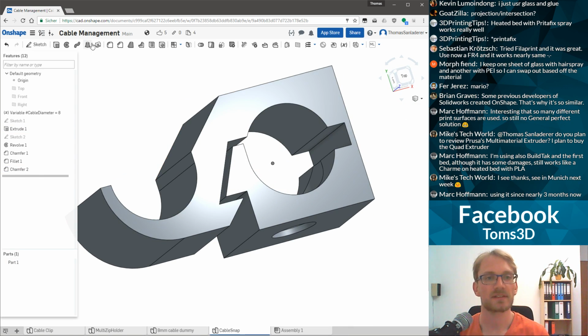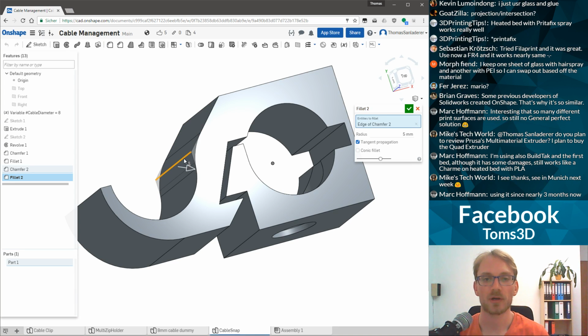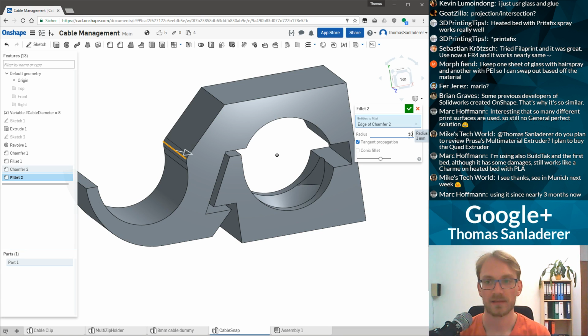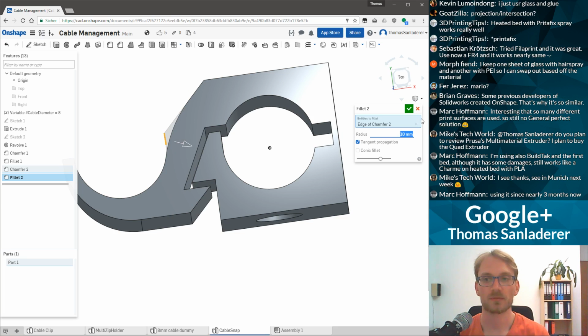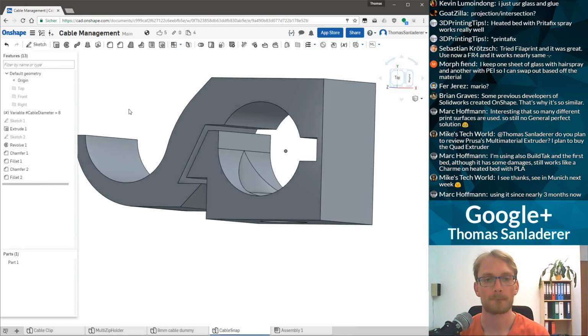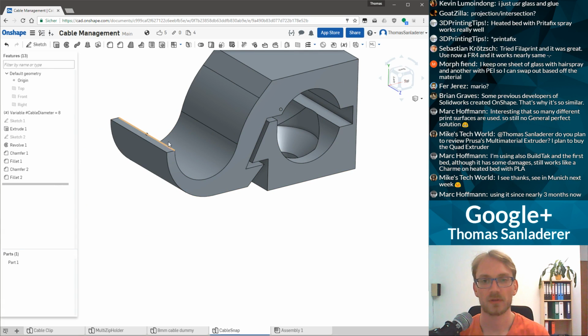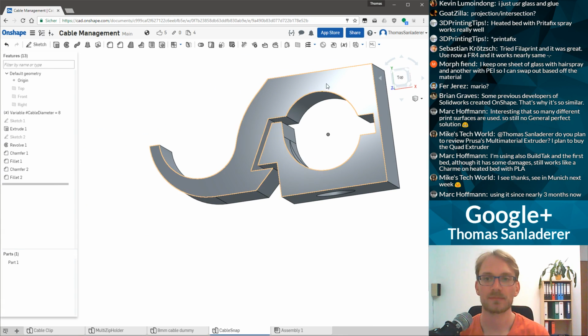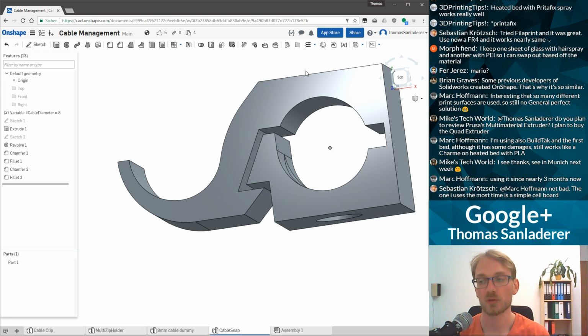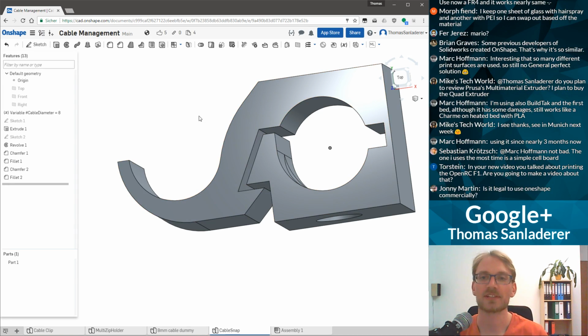I know this is not the cleanest approach, just reshaping your part with chamfers and fillets. I find it usually works pretty well, and it makes for some pleasing geometry usually. There's a lip to put a finger into. I'm not sure if this is actually thin enough to bend away like this. We could run a simulation, but I've not done that in Onshape yet.